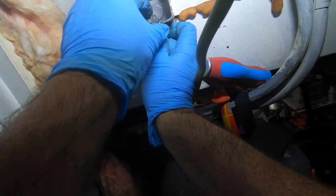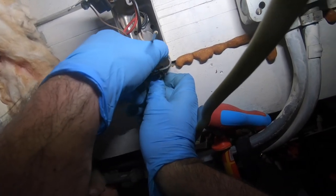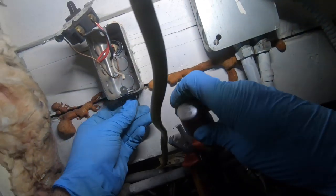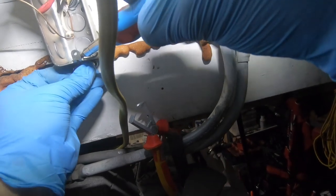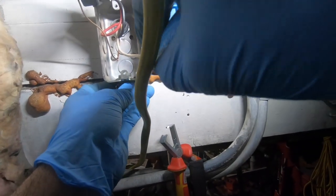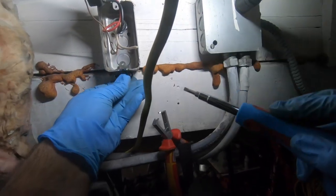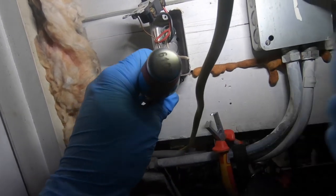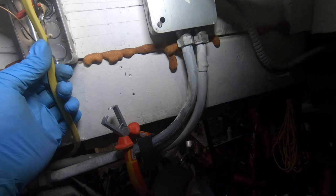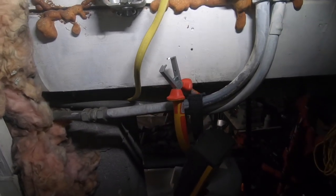But if you're gonna cross thread something, cross thread a lock nut, nothing else. By design, it's very easy to cross thread. It's not like a gas pipe or bolt, it's got like a flat side to it, so you can hammer to tighten these lock nuts in. Okay, so if I'm gonna be right here, coming through, that's where I'm gonna wanna stop stripping it back.